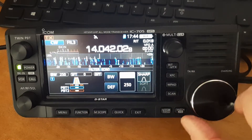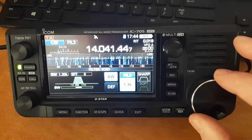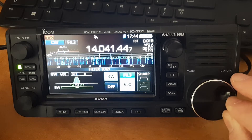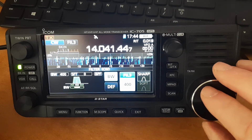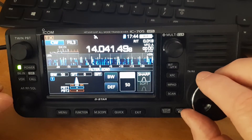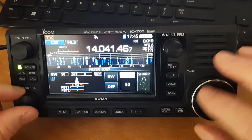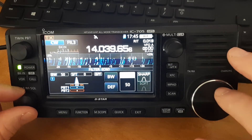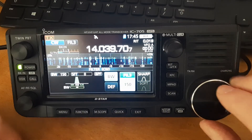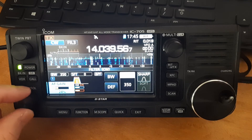We can tune to a signal here — I'm very wide here, and rather than going to another stepped size, I can vary it in 50 Hertz or 100 Hertz steps until I get down to 450, and then it's 50 Hertz steps. Touch it again and it's back to being a VFO dial. It's pretty handy to do that on the fly and not be relegated to whatever three bandwidths you have programmed in already for that particular mode. Okay, that's it — I'm liking the radio quite a bit, it's a keeper. 73 73.